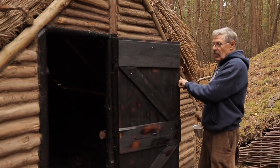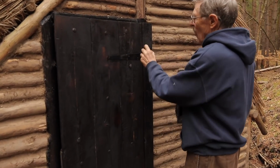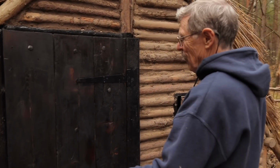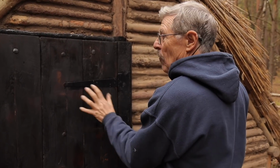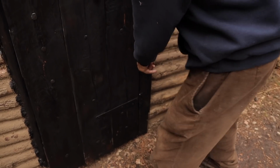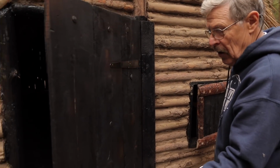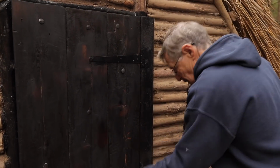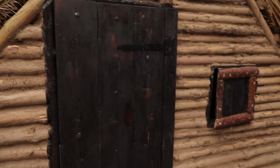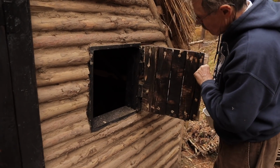We altered the hinges because before, if you do the hinges too tight, too close, and I've done it for years and I still don't learn, when you go to close it, it stretches and springs the door at the bottom. This way, I altered that hinge and made a little bit bigger gap at the bottom, just millimetres, and look, the door will close properly on its own. So that's fine there. And on the window I sorted out the hinges and rounded them off. It's still a bit crooked.